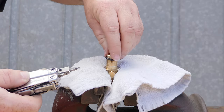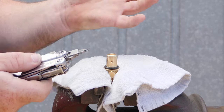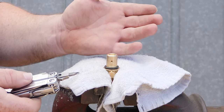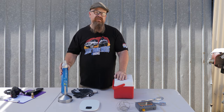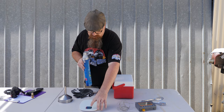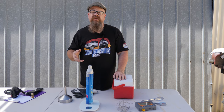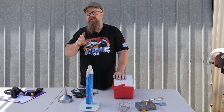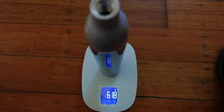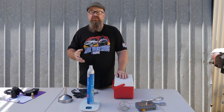Now we've got it apart we'll fill it up with dry ice. To fill our cylinder, we need to get our tare weight — the scale comes in at 618 grams. It'll be a little hard to see on video so I'll get a better shot of the scale. We need to fill it to 1018 grams to get a full 400 grams of dry ice in the cylinder.